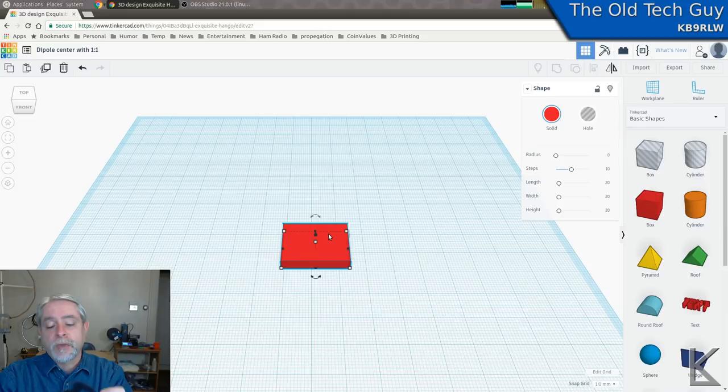Yeah, I need enough space to accommodate the connector and crimp the coax. So up to the base of the connector, I'm going to need 50 millimeters, I guess. And then from the connector up, I need to accommodate the 1-to-1. So, and top to allow for, let's see, this could be about there. So I'm going to need another 60, so about 110 millimeters tall.